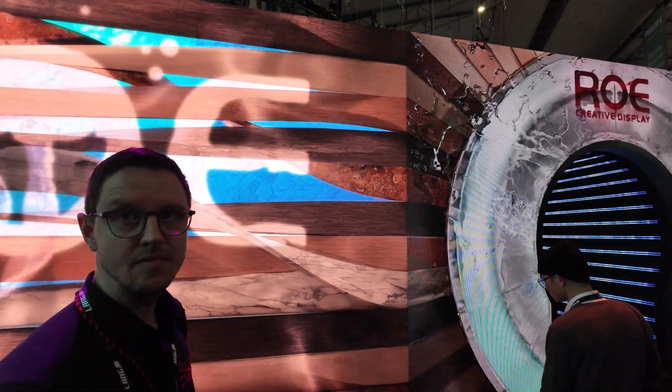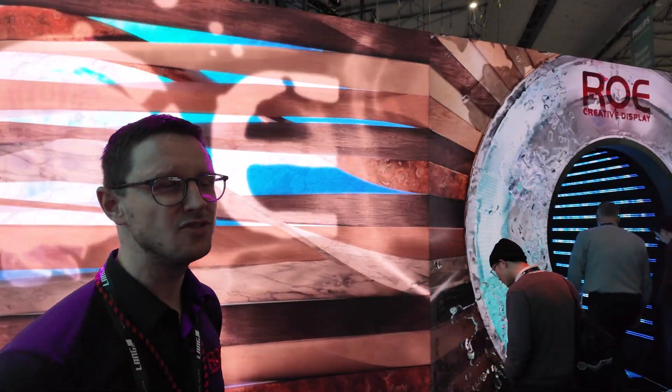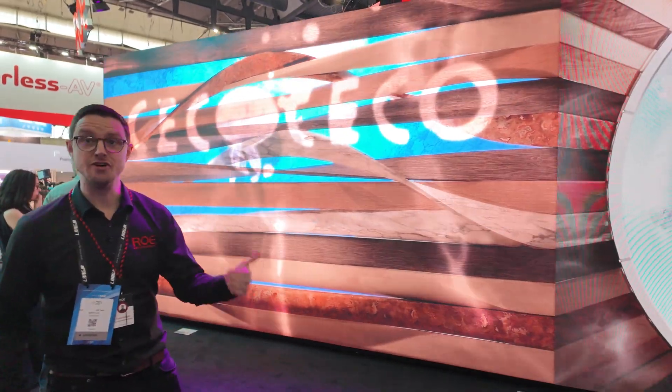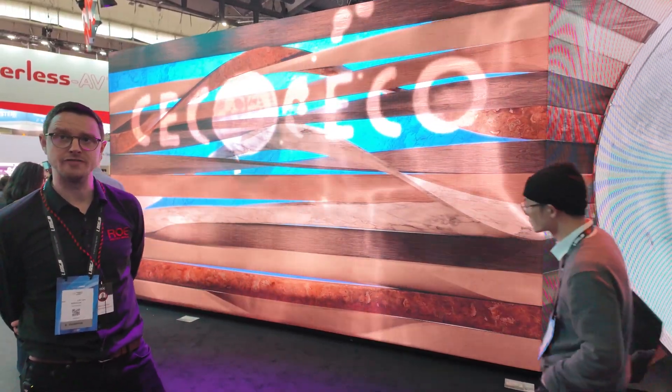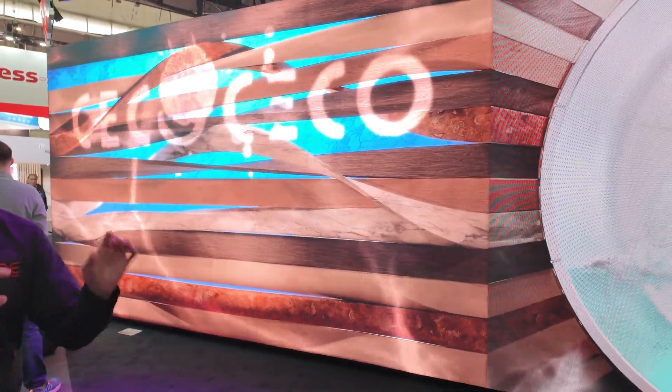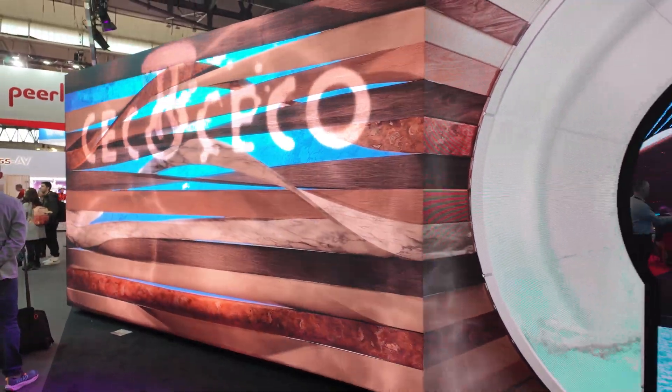What's the dot pitch of the LEDs behind the covers? It's about five or six millimeters. You don't need to go to a very high pitch because you're combining it with the texture — it just needs to be bright enough to get enough light through the cover, but small enough that you don't get hot spots. It has to be evenly dispersed.